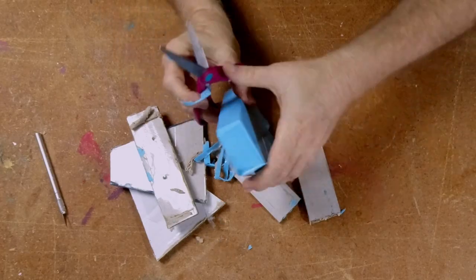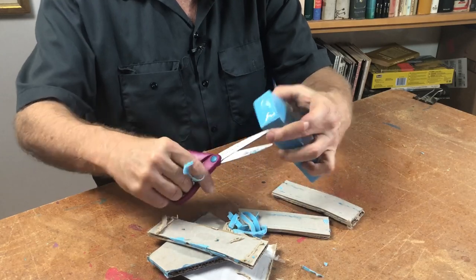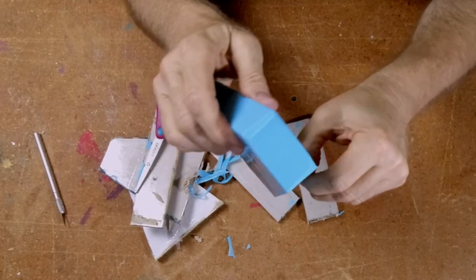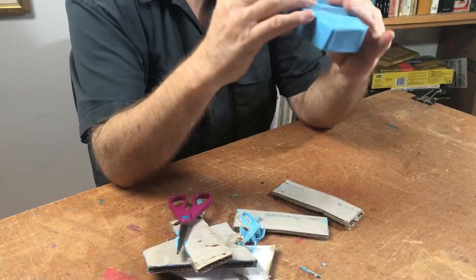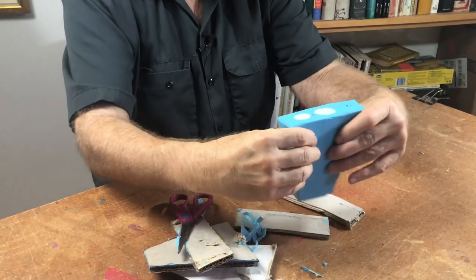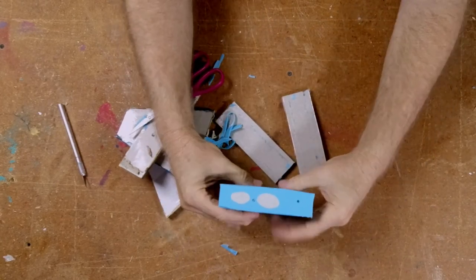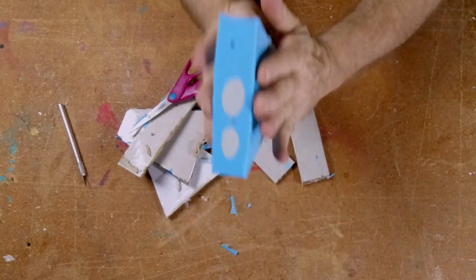I just go around with the scissors and cut off the flash — kind of clean up the mold. It just makes the mold look a little tighter and neater, easier to handle. Same with the top — this is not a precision job, just nicking off the extra rubber. That's a nice tight little mold. Very nice. We're going to build a case for it because it's too floppy by itself — it's got big flat sides and is way too floppy to just rubber band it.